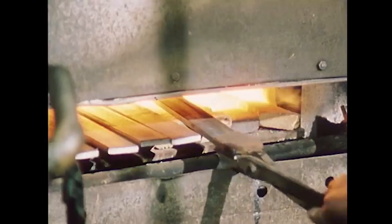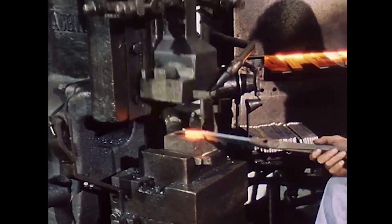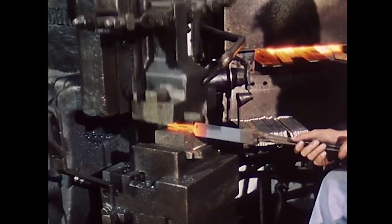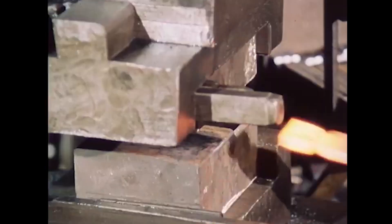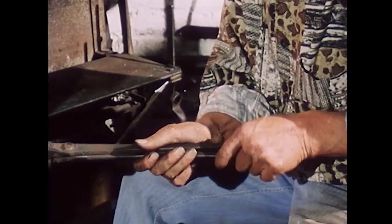The perforated pieces are then worked on by skilled filesmith Friedel Steinkemper at the forging hammer. The blanks are heated in the forge to the usual temperature of 950 to 1,000 degrees Celsius. Forging is a highly skilled job requiring intuition, as company owner Horst Ehlis emphasizes — an art that one must master.